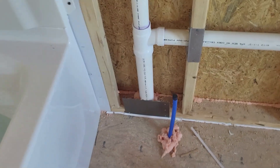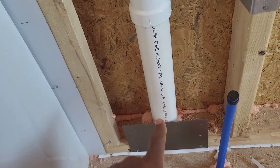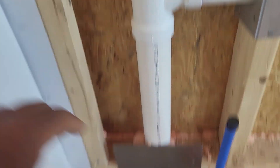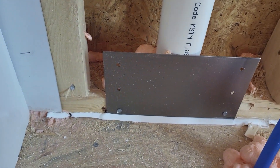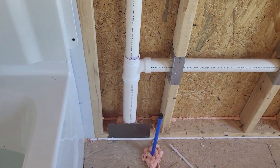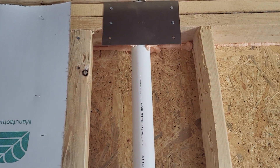And last but not least, let's talk about the Boca plate or the metal plate. These are typically used for plumbing. They're used when the lines are running vertical and they tend to extend up about two inches from the bottom plate or two inches from the top plate. When that drainage line or water line is closer than an inch and a quarter to the edge of that bottom or top plate, you will need a Boca plate or a metal plate.